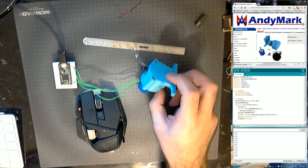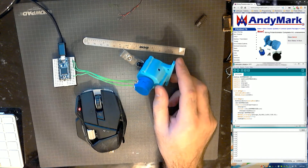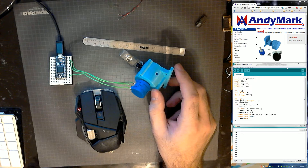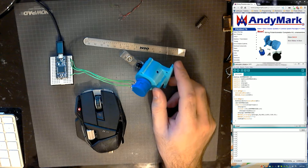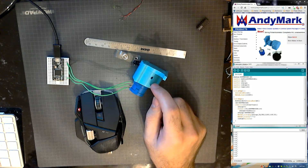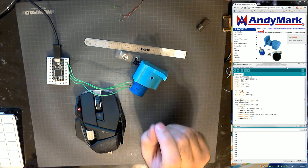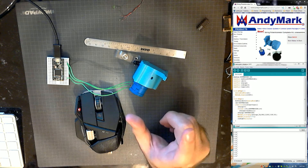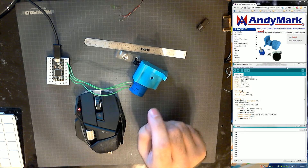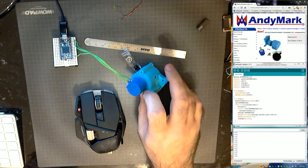As you can see, it's made out of plastic. I did have a couple of issues with this. When they shipped it to us new, the potentiometer hole is actually missing. We got an email from them saying they made a mistake and shipped us ones with that missing hole. The ID of this plastic case is an inch and an eighth, so what I actually did was took a half-inch ID bearing with an inch-and-an-eighth OD with a flange, and in that I took a half-inch to three-eighths reducer so I could get my hole centered. That's how I was able to make that hole.